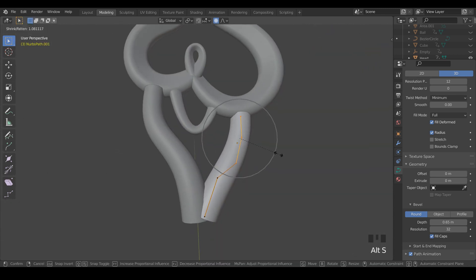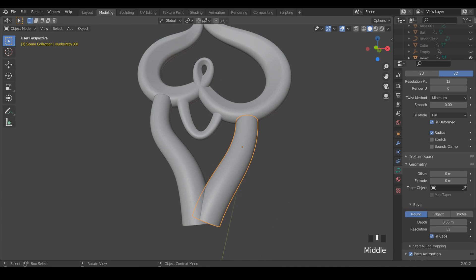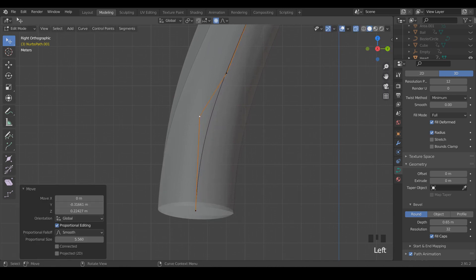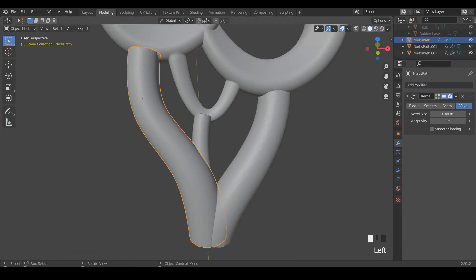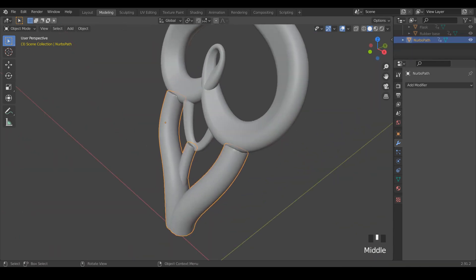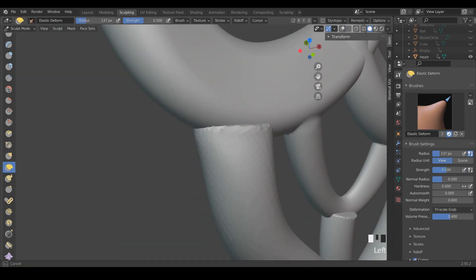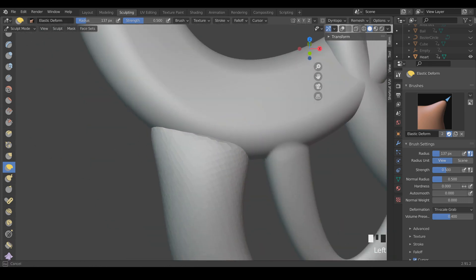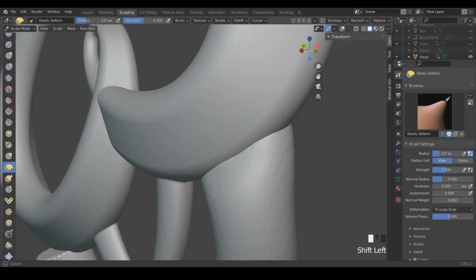I'm kind of going through and really over-engineering what's needed in order to cast this piece, but I wanted to make sure that I have a smooth transition for the flow of metal and have the sprue attach in areas that are really easy to clean up after casting. Once I have the sprues in place, I'm going to convert them to mesh in order to combine them with the charm itself. I'm going through with the sculpting tools in Blender to adjust the parts of the mesh that are connecting with the charm, just to make sure that the flow of molten metal doesn't get interrupted by any sharp edges during casting.